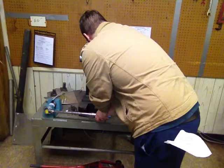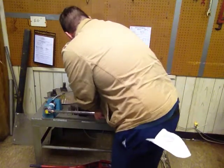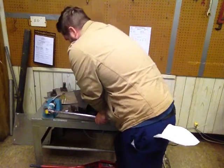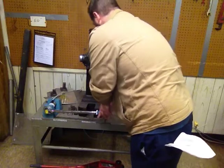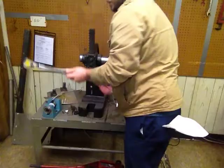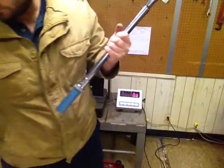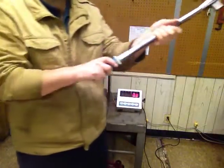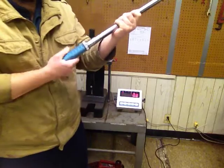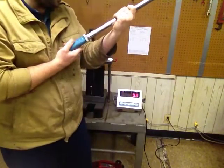See if you can hear the click from there. That's 1, 2, 3. So we've got it exercised. Now the first point we're going to test is 75 foot-pounds. We're going to do the same procedure 3 times and write down the readings so we can make sure it's within specs and accuracy.